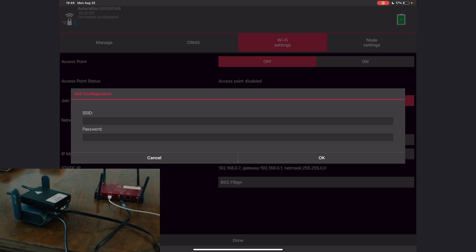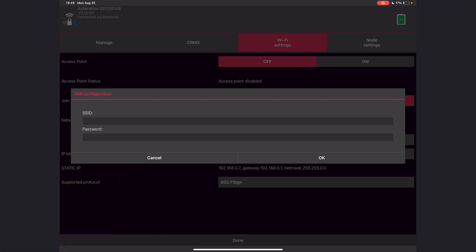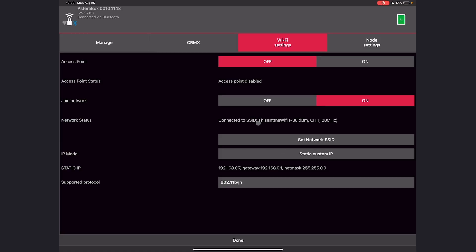The ART7 has a pretty weak antenna, so make sure it's very close to your router. For this initial connection, I recommend turning off any CRMX receivers and avoiding spaces with a lot of 2.4GHz interference. Sometimes you'll have to power down the ART7, wait a minute, then retry — but once you get the connection initially, you'll never have to do it again. You can see right here it says I'm connected.